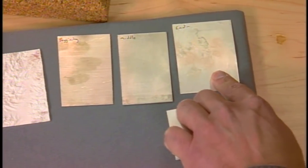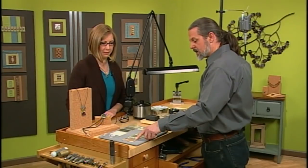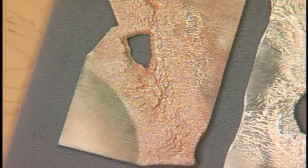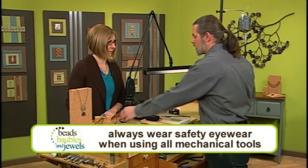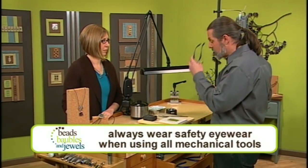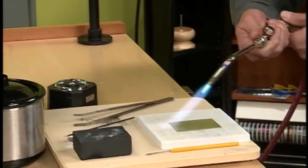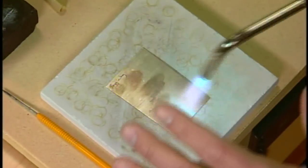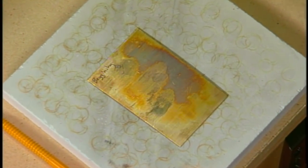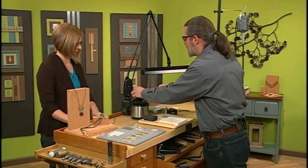You can see it looks a little bit more powdery, and what we hope to get is that moonscape or desertscape kind of texture when you look straight down at it. So let's do that first process — you're going to warm it up, not really heat it that hot, just get it to tarnish a little bit. So we bring out the torch and take it to a couple hundred degrees, see how it's turning color, and then while it's still warm — watch yourself, it's going to splatter a little bit.